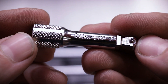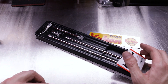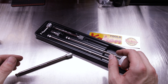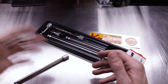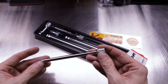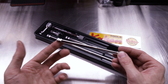Another cool thing is the way they designed this knurl pattern. When you put your extension down on something flat, it normally wants to roll away. But with the way Koken designed the knurling pattern, it acts like a flat bottom — so if it starts rolling, it will find a flat spot and stop itself. A normal extension will just keep rolling away as long as it's got an incline and some momentum, but not with the Koken. It's not going to roll away, and it's got super nice deep knurling for good grip.